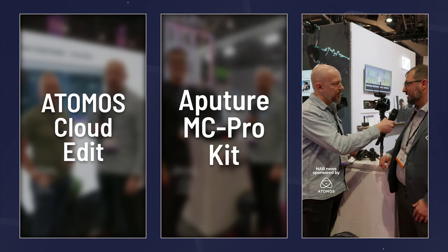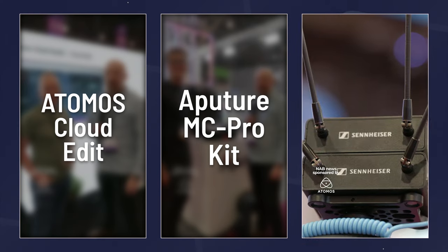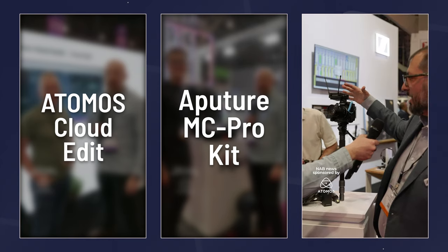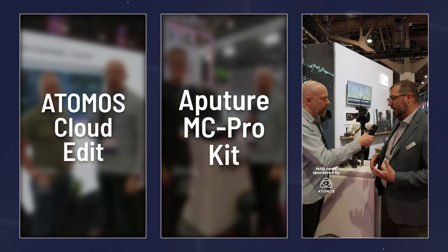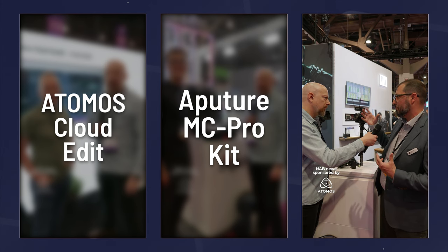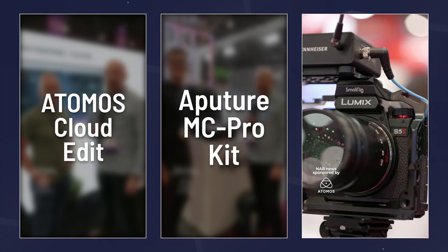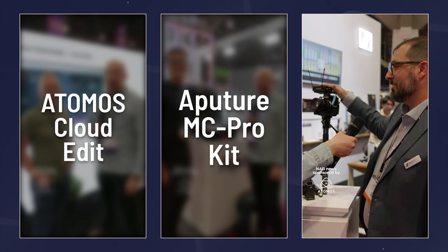We'll take a look at the Evolution Wireless Digital Portable, or EWDP. It's the next product in the Evolution Wireless Digital line — a small form factor diversity receiver that can mount on a magnetic cheese plate or shoe mounts. It comes with all the cables you need, and can be powered via USB, rechargeable battery, or AAs. It works with the EWD transmitter for body pack and handheld systems, with a plug-on coming in October. It features a fully digital transmission path, a Smart Assist smartphone app for iOS and Android, and all devices are connected via BLE — no more infrared syncing.